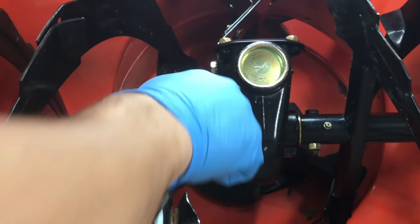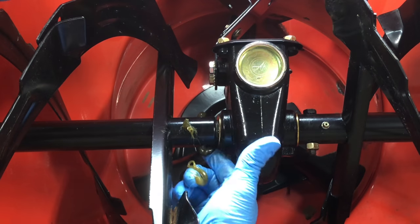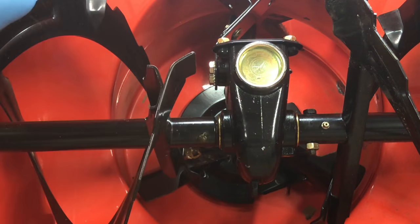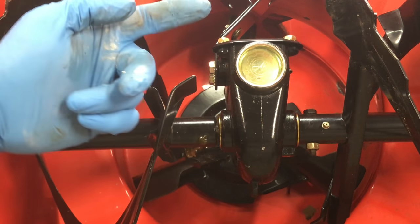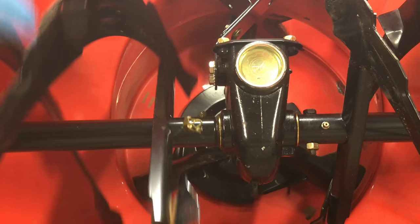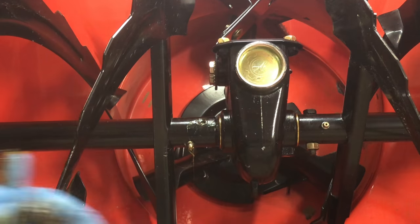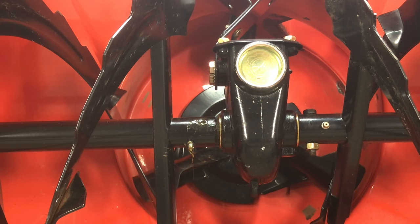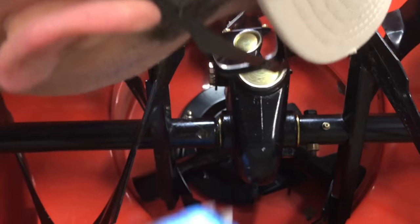What you want to do is spin the auger to lubricate the inside, and you can see some grease coming out of the holes — that's fine. You just want to make sure you have enough in there. Spin it around and let's add a little more in. It's kind of too much, so spin the auger again, spin it around a few different ways — this will lubricate the inside of the shafts. Then wipe off any excess grease with a rag or a paper towel and make sure it's all nice and clean.